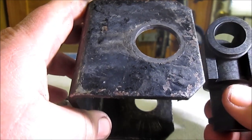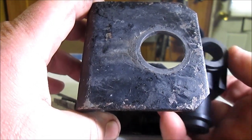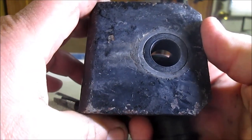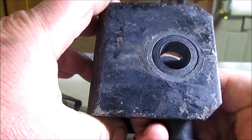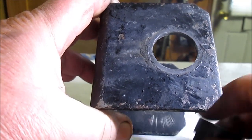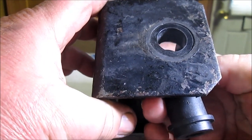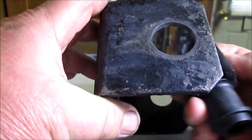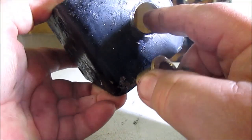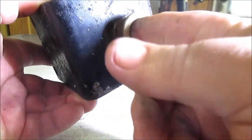I've watched some YouTube videos and got some pretty good suggestions. One of the issues is this brand new nylon bushing fits in here, but I need to figure out how to get rid of that play right there. The old one has the same, maybe a little bit more play, so I'll probably go with the new one. On the other side, I did upgrade to brass because it had just a nylon bushing and I got a brass bushing that fits really snug in there.